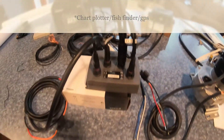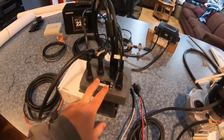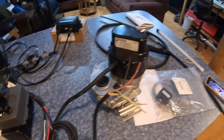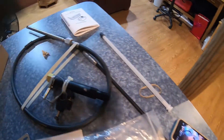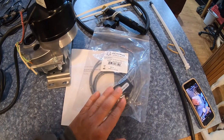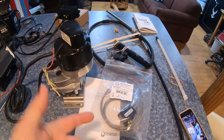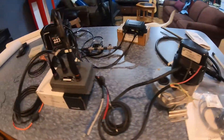Here is the GHP 12 ECU unit — this is where you get your power and all your feedback for everything. Here is the power line to the Octopus Type R mechanical drive unit, and here is the cable with all the components. Also, a most important thing you must have is a rudder feedback sensor. They make different types for different autopilot systems — Garmin, Simrad, Raymarine, Furuno, and a couple others.